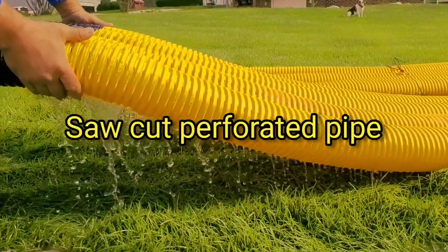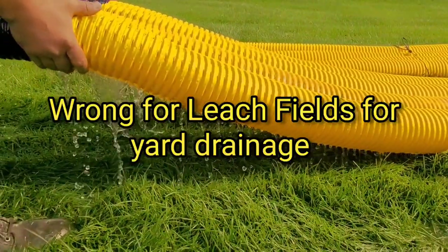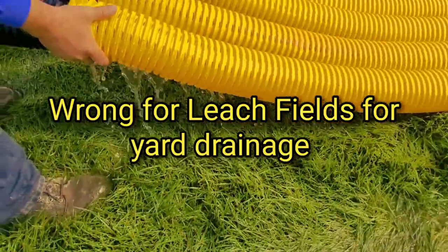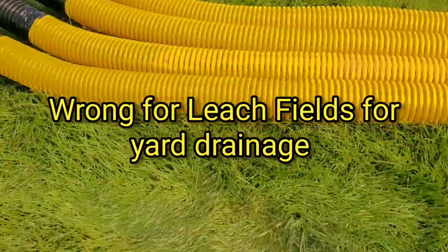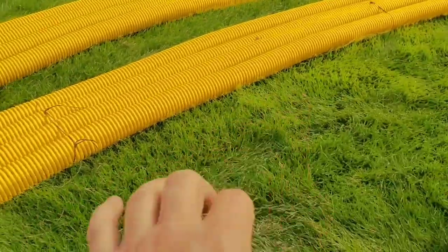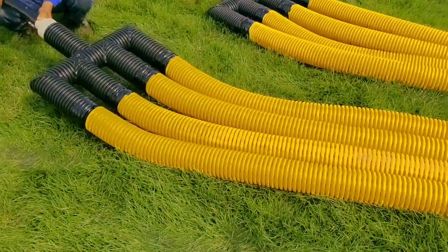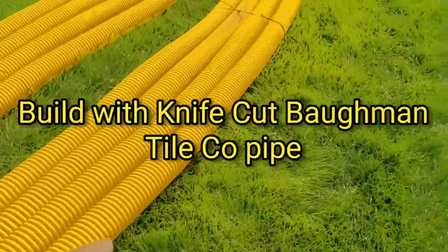The eight-slot just pours out — just like a sieve. All the water just pours out. It doesn't get a chance to travel the length of the leachfield. That's why you build a leachfield: so that you disperse the water over a large area.